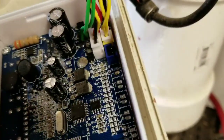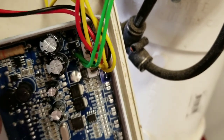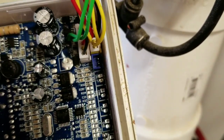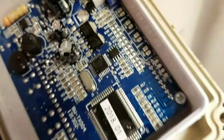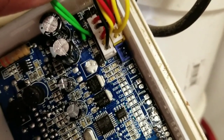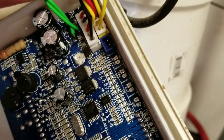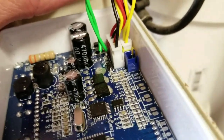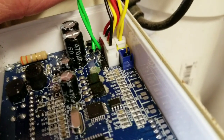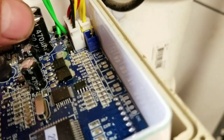The number one question I have is how to wire into the board. You can see there's a component called C14 — C14 — and there's two little bumps to the right of it; that's where the wires have to go. Here's a good picture. It's a C14 and there's two little posts that have a little bit of solder on them. You're going to want to put a little bit of extra solder on them and then tin some wires up — just stripped back a little bit — and then put them on there.